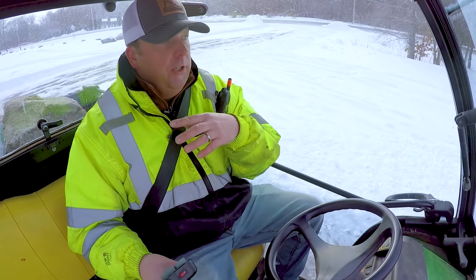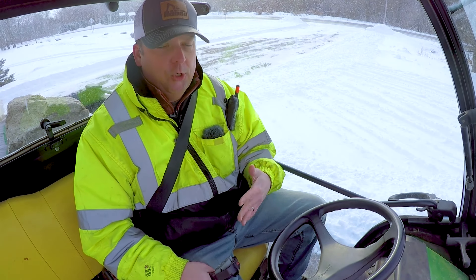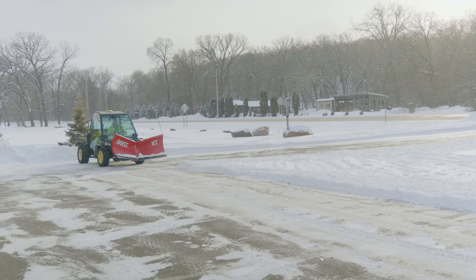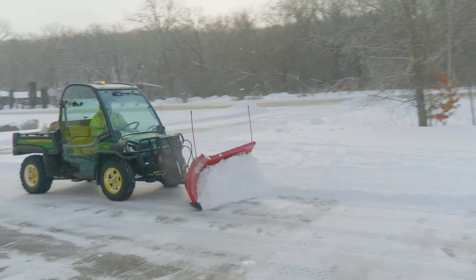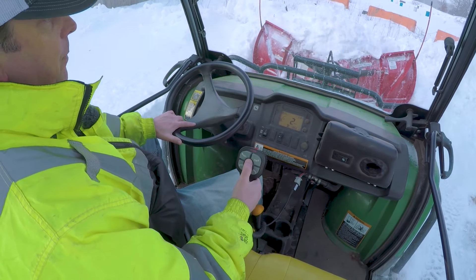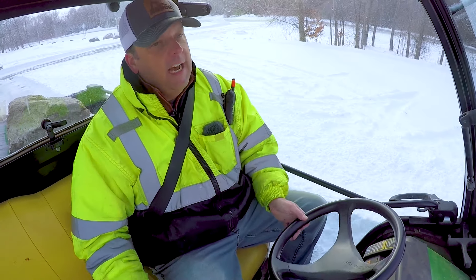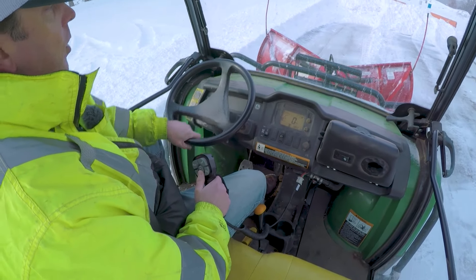Typically you're going to windrow, but the problem with a smaller gator is depending on how much you're pushing, it may eventually not be able to do it. This is where the V formation is really handy. If I'm not trying to roll it off, this will basically scoop it together. You can see it come together as one, and I'm raising it up as I go in. Be careful not to push too far into the pile — they're so much lower and it's not fun to get a shovel and scoop yourself out. I've done it several times.